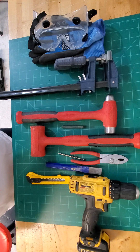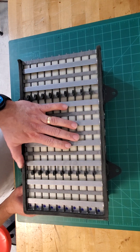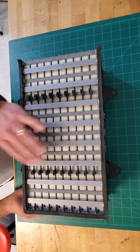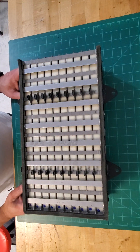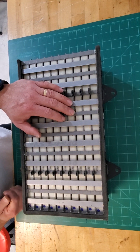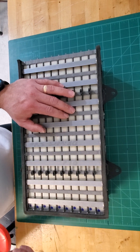Here we have the battery sub pack — this came off of a Lexus RX 450h, which stands for hybrid. It's already been stripped down: the wiring harnesses, bus bars, and temperature sensors on the bottom have been removed. Always use safety first. We'll pop off this vent tube.